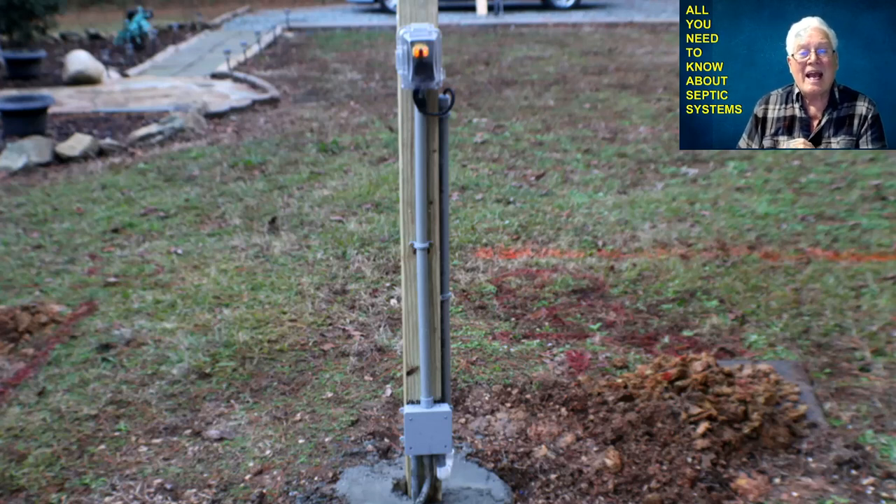I'm also going to add an alarm later on. The main electrical wire from the bottom four-by-four electrical outlet goes up to the weatherproof two-outlet box through that straight gray PVC pipe. To the right, anchored to the same four-by-four post, is the pump float wire — it comes out the top, which is sealed, and plugs right into the bottom of the outlet. The top of the outlet, where you now see a glowing light proving I have electric out there, is where the pump alarm is going to go.